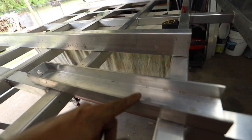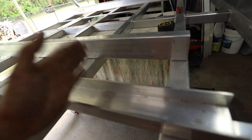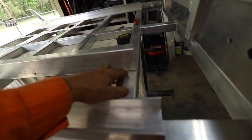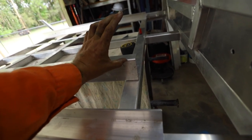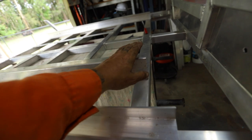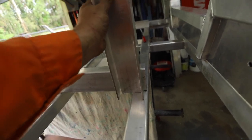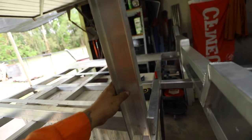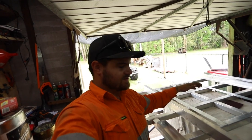I've got to cut these mounts down to the height that I want - I've roughly worked out they're going to be 200mm long, pretty much 125mm longer than the top. They're going to mount like that wherever the supports are - obviously they're too long right now but you get the picture. Let's bust out the welder and start welding these main supports.